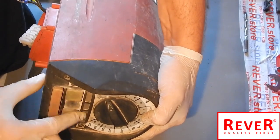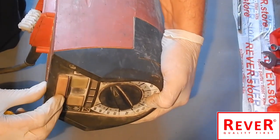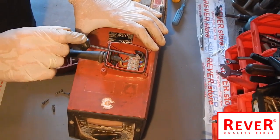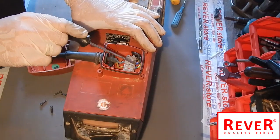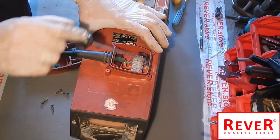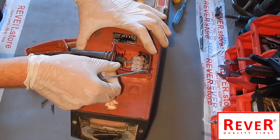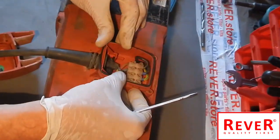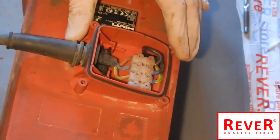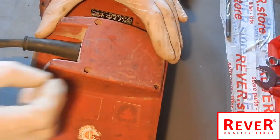Push the buttons — the rubber cover is in a good position. As I told you at the beginning, be careful how to connect the cables: green to green, blue to blue, brown to brown. Do not forget the black seal — it is for water protection. Now fix the cable with these two screws, take the cover, and fix it with four screws.